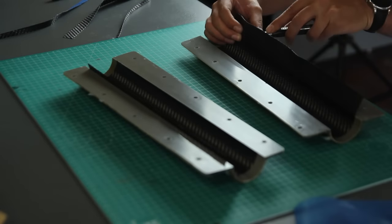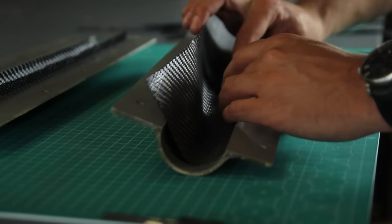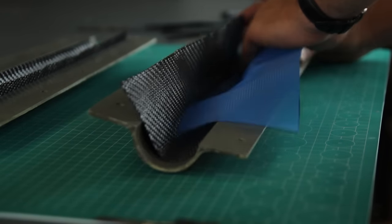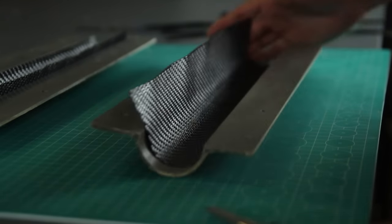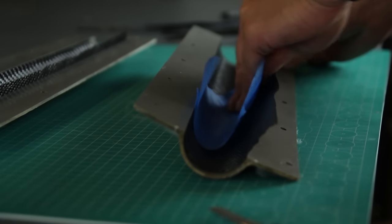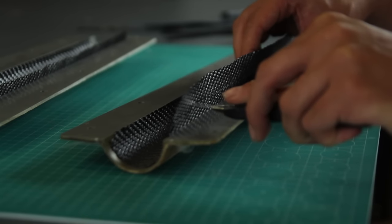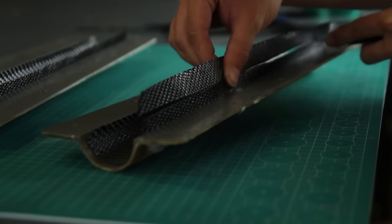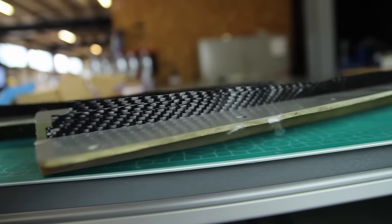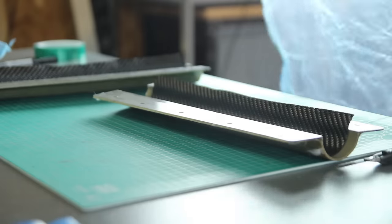For the second layer, I'm overlapping it a bit more on the fibers coming out of the mold, and a bit more on the inside where the fibers sit in the mold. Each layer after layer I use a bit more overlap, so every layer gets fitted and compressed inside the other mold half, layer by layer, adding strength to the part.